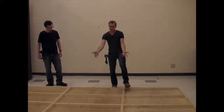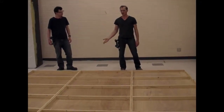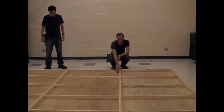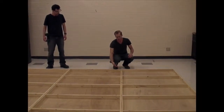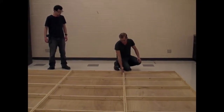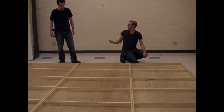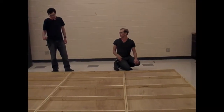There are lots of different places where you can put your screws, but you want to have some order to it — it's going to make the people who have to take the flats down later much happier. I like to put my screws around where the actual toggles are, which helps so you're not going to rip the pine framing from the Luan face and gives you a nice straight joint. If you put them all in from one side — Adam's going to do that seam, I'm going to do this seam — we'll put all screws above the bottom rail, above each toggle, and one at the top. All in the same spot, so when somebody else has to take this apart, they know where to look and won't have to search for buried screws.